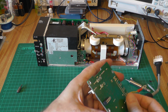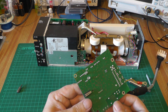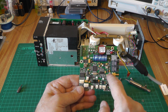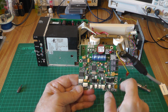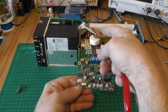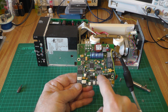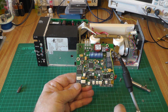On the reverse we've got two very interesting things — I don't know whether these are photodiodes or LEDs, but these couple into fiber optics coming from the guts of the nitrogen laser. There's a little interlock switch on the back, and that's pretty much all there is to it. There are TVS diodes all the way up — some of these surface mount component numbers are a real pain to make sense of because different manufacturers do different stuff. When the nitrogen laser fires it generates a huge electromagnetic pulse which can find its way back into the microcontroller and damage things. There are plenty of opto-isolators at the bottom, so everything controlled before it pops out as wires goes through an opto-isolator first, to try and protect the electronics.